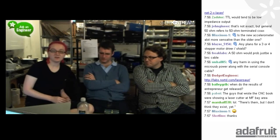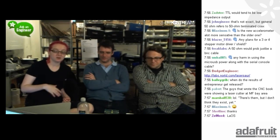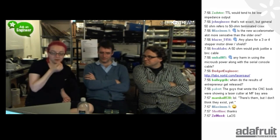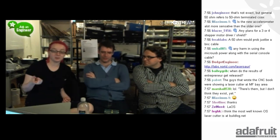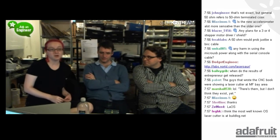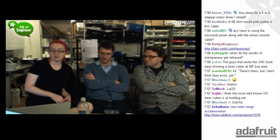Is it more sensitive? It has a wider range. So plus or minus 16 Gs, so it's actually less sensitive because it's a wider range. So the trade-off is it's 16 instead of 3. So per ADC bit, you'll have a bigger step, right? Because you have a wider range. But 16 Gs is good for like rocketry or like colliding things together. Yeah, it's definitely much better.